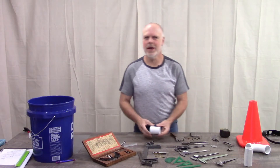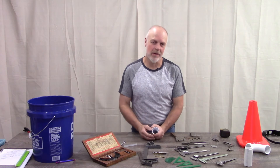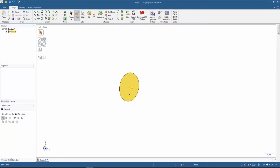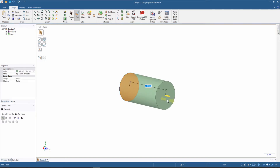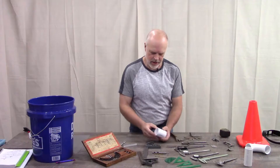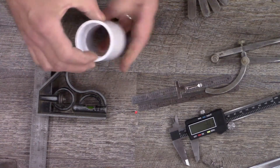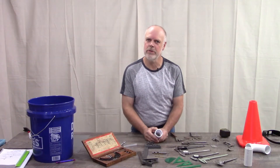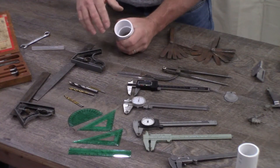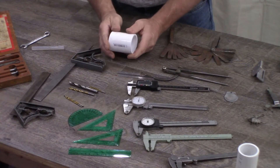The next thing we need to do is model the part in our head so we can plan ahead, and that's a lot easier once you know how the software works. For DesignSpark, I look at the part I'm going to model and figure out — since DesignSpark uses faces and pulls those faces to make the 3D part — how my part compares to what's available. In the case of this PVC collar, there's a flat face I can pull to make a cylinder. Then I can identify all the aspects I need to measure: the plane, the end, the ring inside, the depth, the overall length.